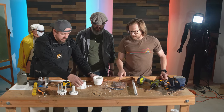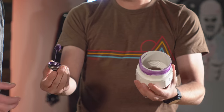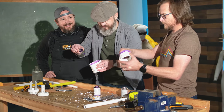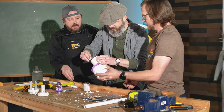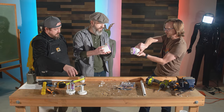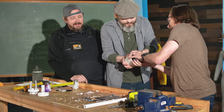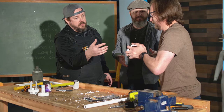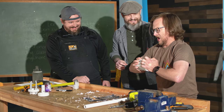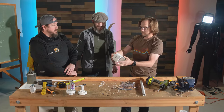Now let's join these two together — primer around the inside of one, primer around the outside of the other, then glue. That smells great. I love the smell of the primer. Slap those two together — we have to do the Interstellar. Just play some really loud organ music. All the way in — hold it for a second because it'll keep squishing apart. Hold it as hard as you can for 45 seconds. Good spot to pause and let the glue dry.